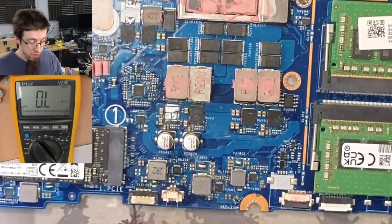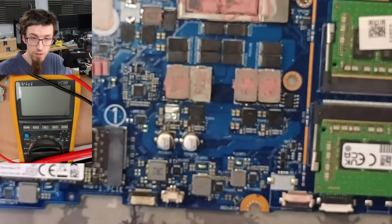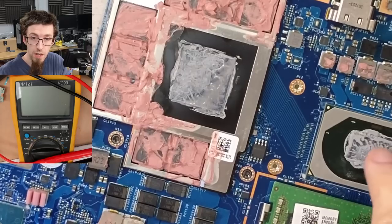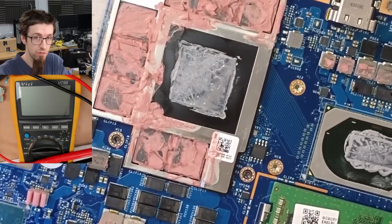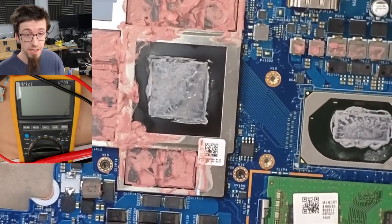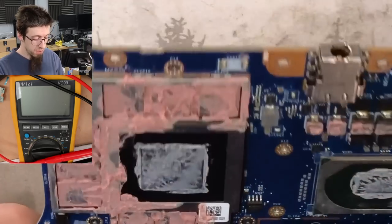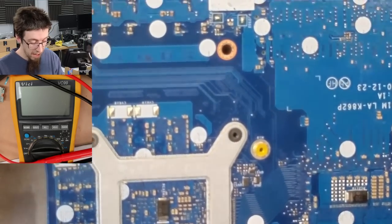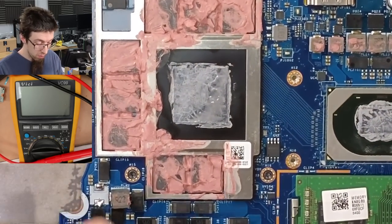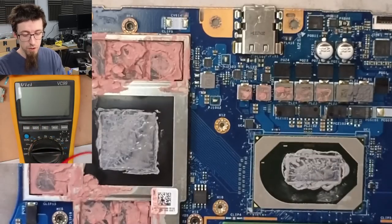Okay, so what I'm banking on now is this is why silicon is spooky, basically, because silicon, and by silicon I mean like the CPU die, the GPU die, has a really low internal resistance. I don't know why. I would be very interested to know why that is and the exact nature of that, so if anyone knows, I'd love to know. Point is, they're low internal resistance. And again, this is why if you measure any of the bypass caps on the back, or if you go into beep mode and measure V-core, it will beep at you. And you'll be like, oh, it's shorted, it's dead. No, that's just what they look like. However, by comparison, the CPU would be a better example of what I'm trying to demonstrate here. Hold on.